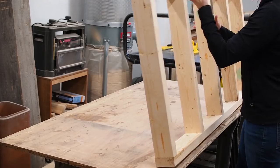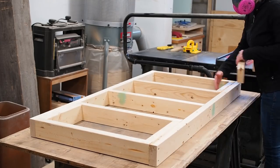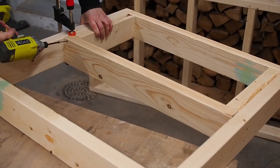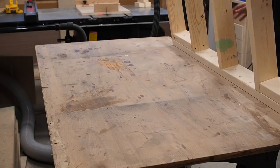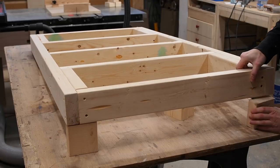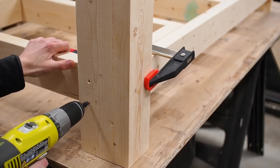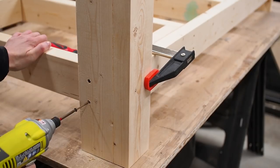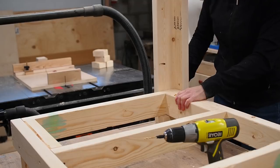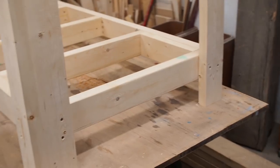Before assembly, I'm going to add additional blocks to the lower frame so that the caster wheels have a big enough surface to rest on. I can reuse the spacer blocks I previously cut for assembly. I'm a big fan of using a physical reference rather than just a reference line when I can. To install the legs, I'm using spacer blocks to raise up the lower frame to the desired height. I can then position the front corner legs and attach them, first making countersunk pilot holes and securing them with screws. The back legs are single 2x4s that I lined up with the back edge and used a speed square to make sure they were square to the frame.